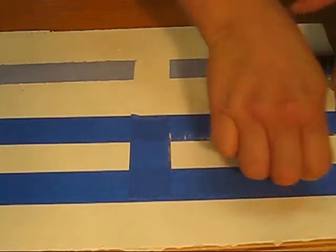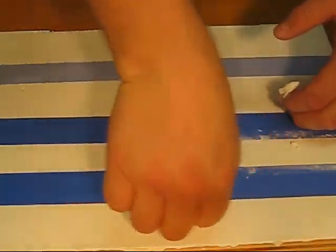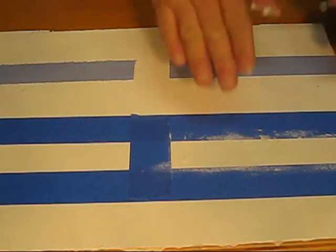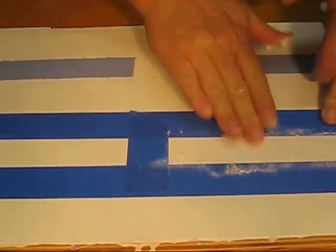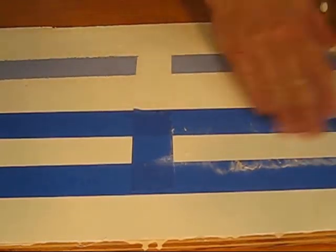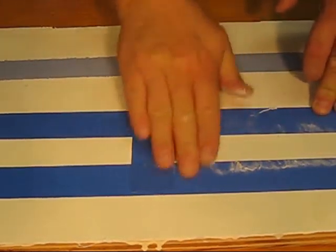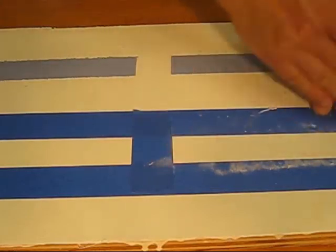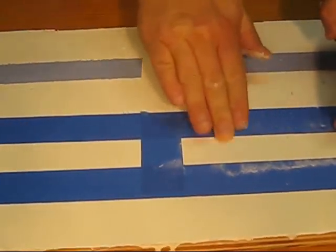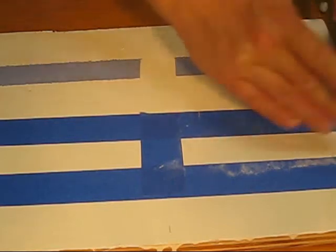If it's fresh stuff it'll go on real quick and come off real quick — that's just what you want. What we're going to do is caulk the seam with this painters caulk. It takes a paint. Once you have it there, then what you can do is wipe it all off — it'll just ball up and come right off, fresh or old. Let it dry if you want but it'll ball right up. What this is doing is it's getting underneath the tape and sealing that void between all the grains, or like in your plaster wall any of your imperfections. This fills in that gap. It's painters caulk — paint right over it, go about your business.